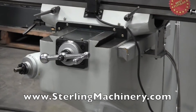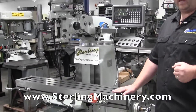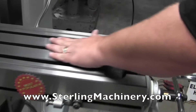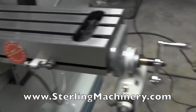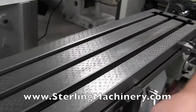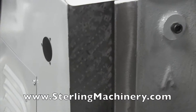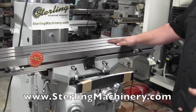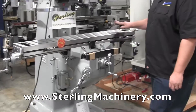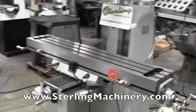The LMC50 is going to be more of a great maintenance machine — a machine in the shop that's not doing full production every day, not working really heavy. You'll notice the table size is very similar to the other one, but if you look closely at the table, you'll see all these little scraping marks. What these do is allow for even oil distribution across the table as well as the ways. These are chromed and scraped ways on the front as well as the back, and the knee has the same thing. On the LMC50, that's going to give you a lot longer life. The table will basically last as long as you keep chips out of it — it does have chip covers, as does the AM2V. These ways are going to stay in really pristine condition due to the scraping.